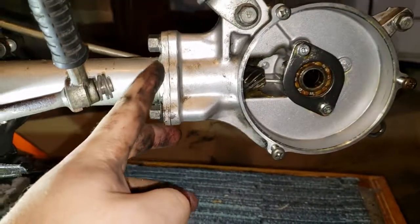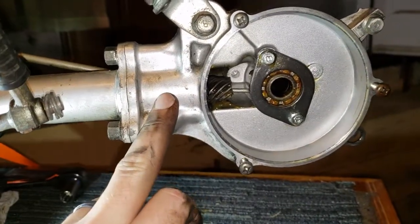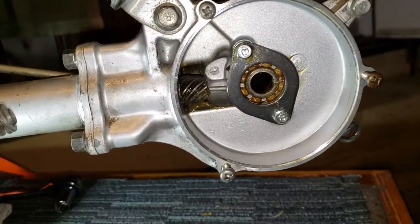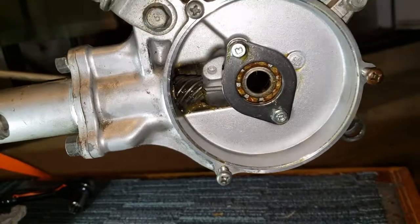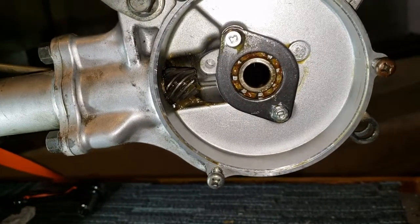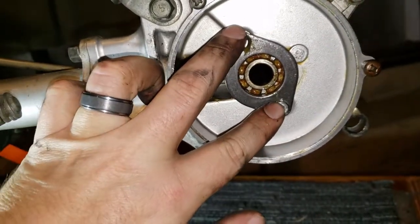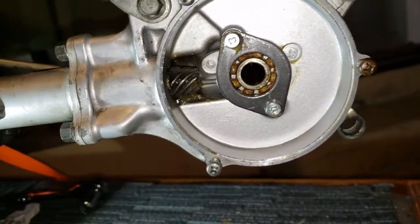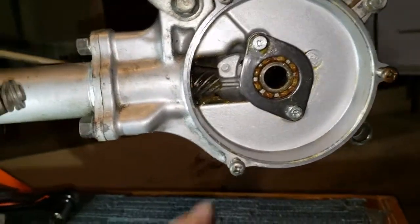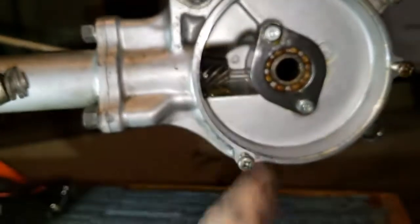I took off those bolts and got to this final gear drive. Once I got in there I saw that it was operating really, really smooth and the bearings looked good, so I didn't see any point in fiddling with those — especially since one of the bearings would have had to be taken to a shop to have them pressed off and the new ones pressed on. The next thing will be these two bolts to get down to our two sets of wheel bearings. You can also see that I've cleaned all that old grease out, and when we re-grease you can see there's a pretty big pocket down in there — that's where all the fresh grease will go.